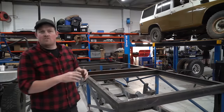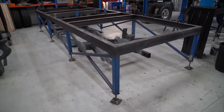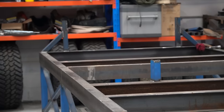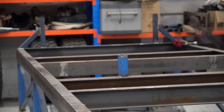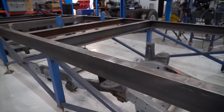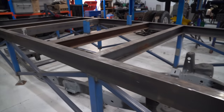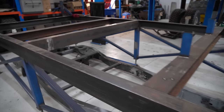We use the table when you're doing chassis extensions or major modifications to the rails where we're putting a lot of heat through from excessive welding or cutting. We'll set the chassis up, weld the chassis to the table, then add a heap of extra bracing as required depending where we're working, which will allow us to do extensive modifications to the rail without any warping.